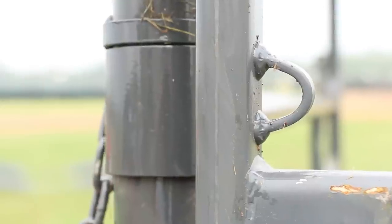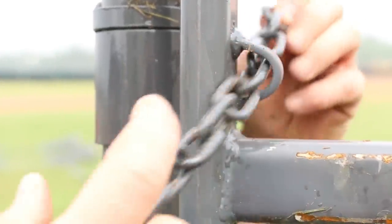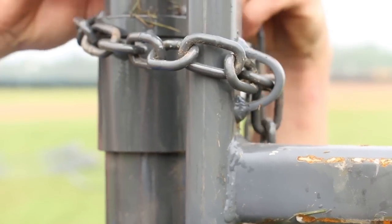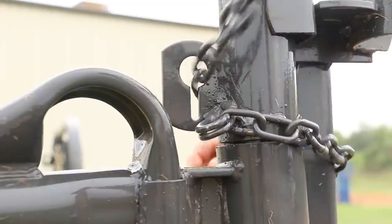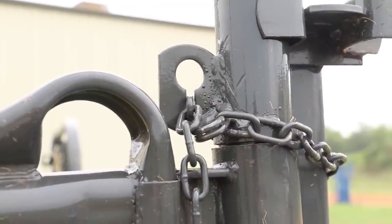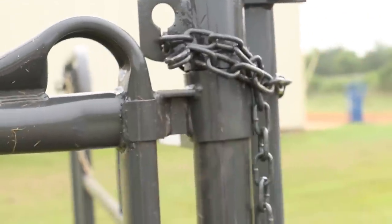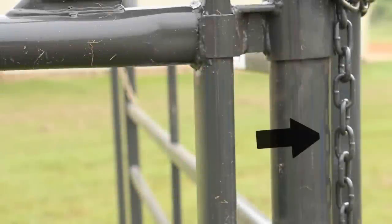You should now chain the bow gate to the panel with alley frame by taking the top chain on the bow frame, around the outside, through the keeper on the panel with alley frame, and through the keyhole on the bow frame, locking it securely into place. It's helpful to tuck the chain out of your way by running the excess down through the connected loop of chain so that it rests along the bow frame.